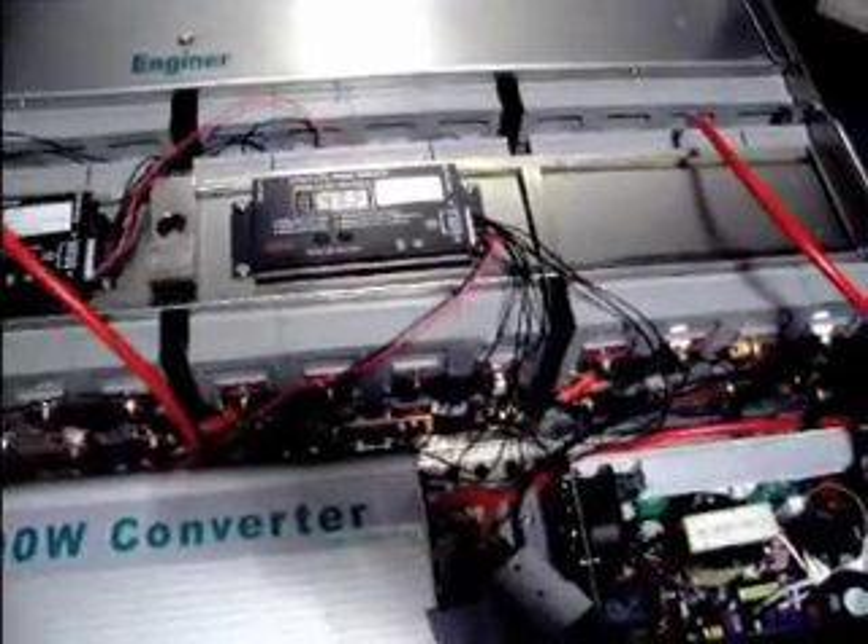I finally got the pack all rewired. Unfortunately when Ben left we hadn't checked, but the wires to the balancers did not all fit — some of the leads are different lengths. You can see on this one, this positive lead has a little extension on it. That one has to be going to the far balancer in order to reach, so I ended up having to swap the balancer harnesses on each battery cell.